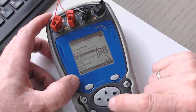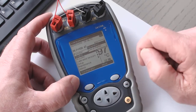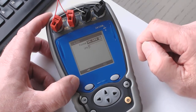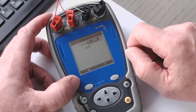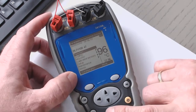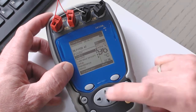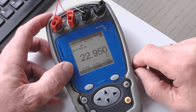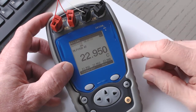Another possibility is 'Scaling' — scaling on/off — and I can also define the scaling. For example, if I'd like to have three digits behind the decimal point and the unit is centigrade, I can confirm this and activate the scaling. Then I have three digits behind the decimal point and the temperature is indicated with very high resolution.